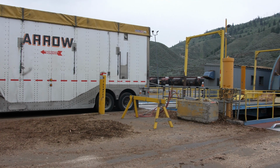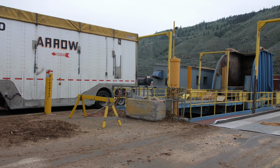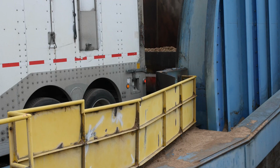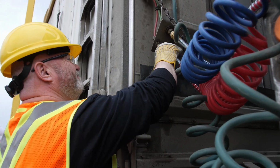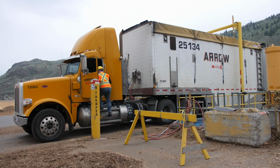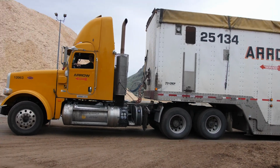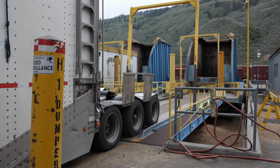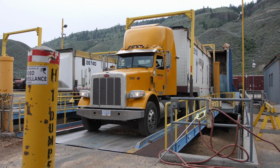If you are required to enter your trailers for any reason, they must be pulled off the dumper and you must notify your dispatch. Like the B1, B2 split dumper, back onto the available dumper platform and prepare your B trailer for unloading. Then pull away and back on the second platform. As the hog dumper platforms are long enough, you do not have to disconnect your tractor from the lead trailer.